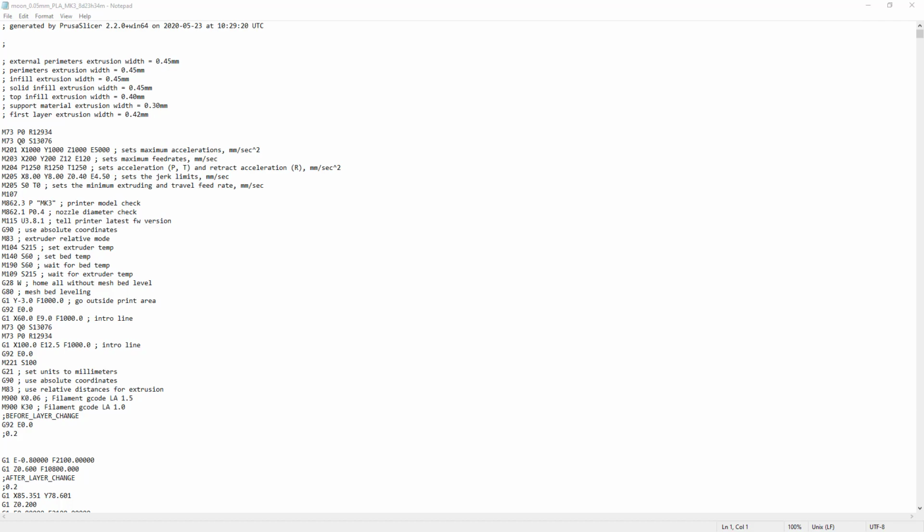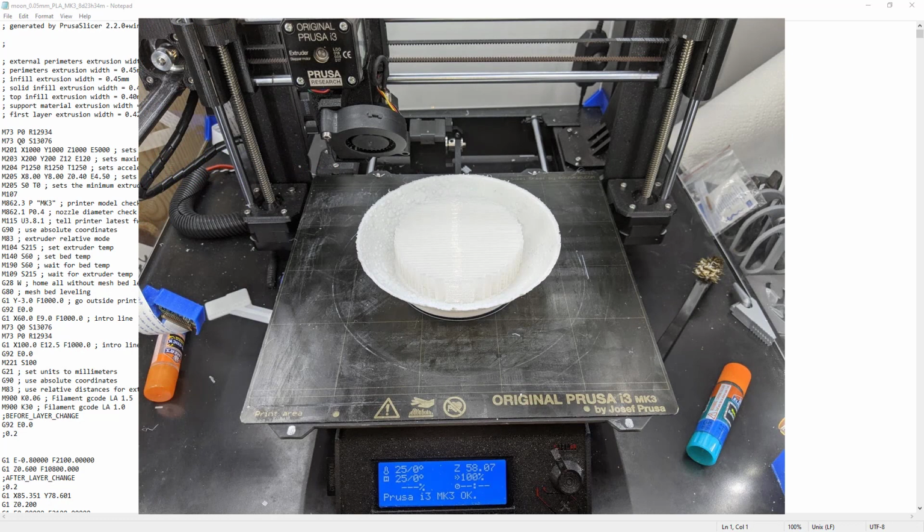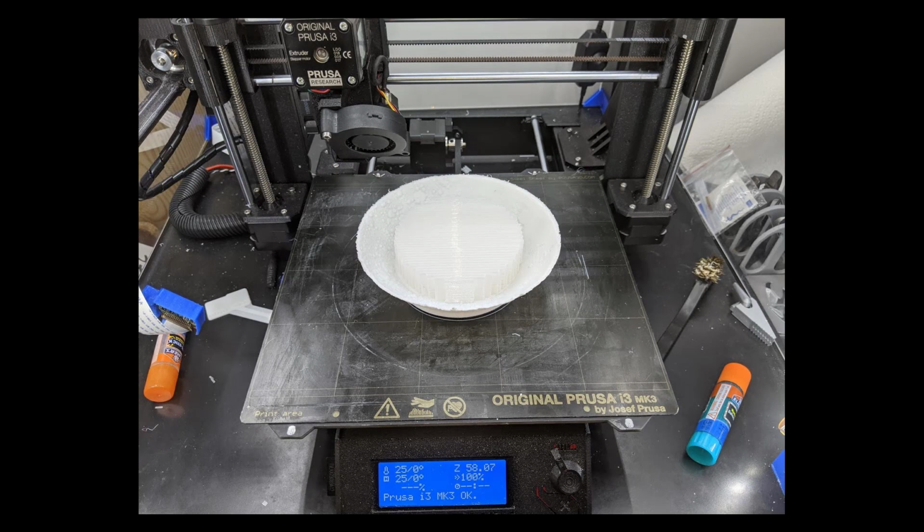So in this case, what you need to do is make sure your nozzle is nowhere near the print. Try to figure out what caused the problem. In this case, most things like that are going to be easy to fix. Just unload the filament and run some new filament through, and it should be fine. Chances are, with something like this that's highly detailed, just how the machine works and how it's built, you can run into problems like this. With that in mind, once things are working great, make sure your nozzle is cooled off, because you don't want it to leak out over your print.